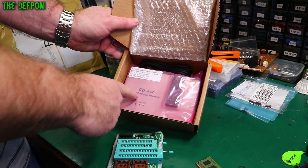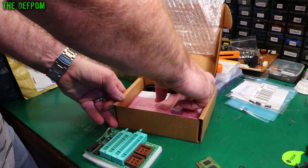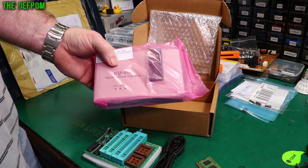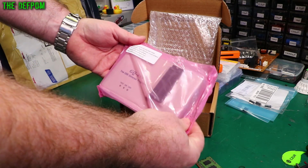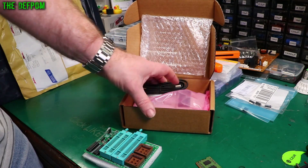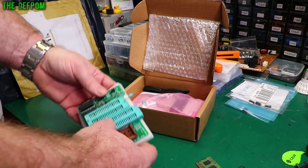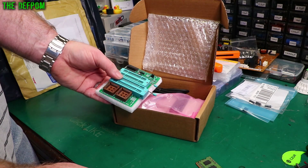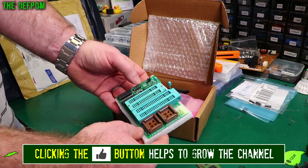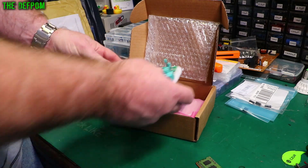So this is the GQ 4x4 True USB Universal Programmer, with an adapter board. I saw this on someone else's channel — I think it was Tony's, Tony Orbis. I saw that on there and I said, thanks a lot, now I've got to buy another programmer. It's the latest model — USB driver 3 and software 7 or later. When it comes to programmers, you can almost never have enough of them. You'll find that some programmers will support some devices but not others, so getting a selection is always good. This is an expansion board you plug into it. Jump settings for different EEPROM types and device types. Thanks a lot Tony.